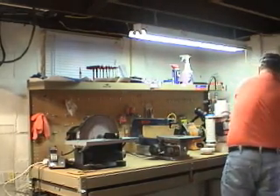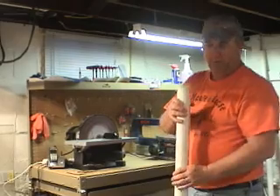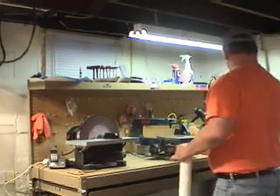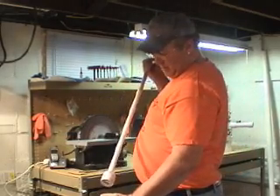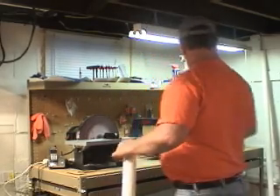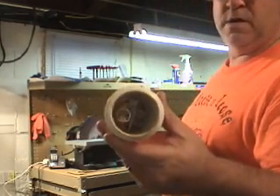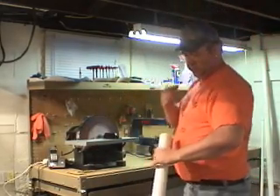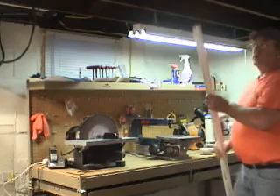Let me show you the barrels. The first one is a 2-inch barrel — 2-inch diameter, 44 inches long. You take the potato, smack it down in the barrel, then take this ram, stick it in there, and push the potato all the way down until it reaches the bottom. There's a little screw in here that stops it and keeps it from going down inside the combustion chamber. Usually this barrel is screwed onto the combustion chamber for loading the 2-inch — you just leave it on there.